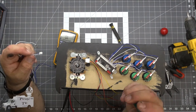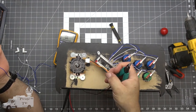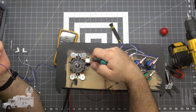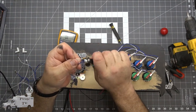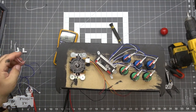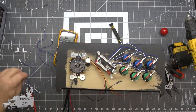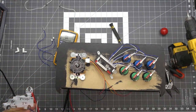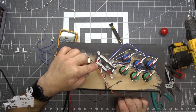We're going to do something a little different for the joystick. It's supposed to plug in here. We don't have the outlet with a 4-pin connector to plug it in there. The alternative would be these 4 connections here. But each one doesn't need a ground. So we're going to cut the grounds off for the sake of simplicity, of 3 of them, not all 4. And just one will have a ground. We'll make that up. This is up, down, left, right.